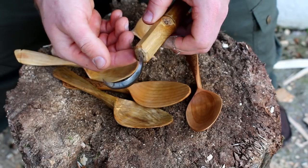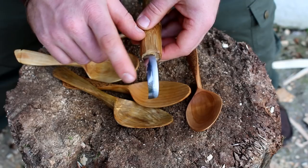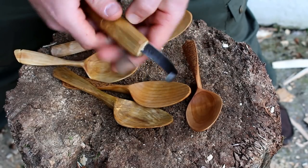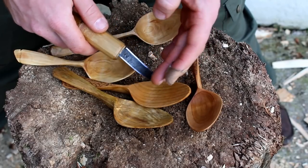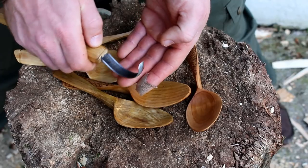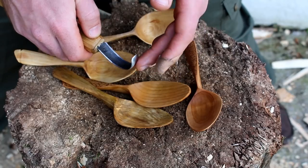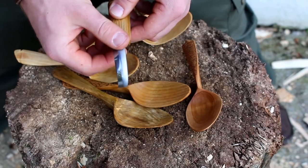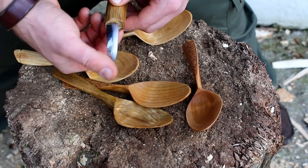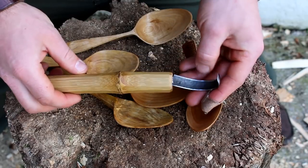It was a pleasure, it is a pleasure to use. It cuts really well. The straight bevel is maybe... It cuts well, it also bites well. It's just a little bit less comfortable or easy to get out of the cut, so I get a little bit of scattering about over the surface on some occasions, but I'm planning on continuously, when I sharpen it, making it slightly more convex so it comes out of the cut as nicely as some of my other hook knives.